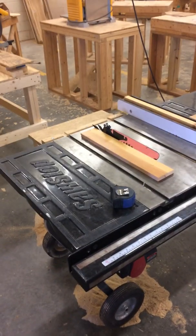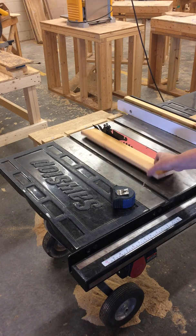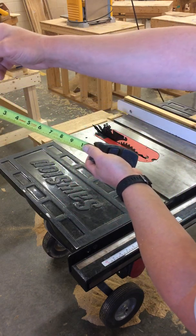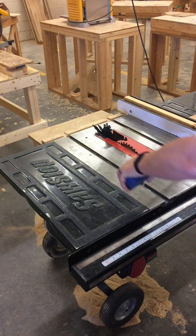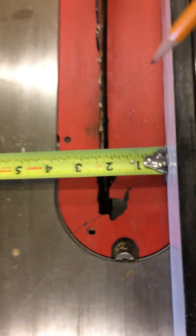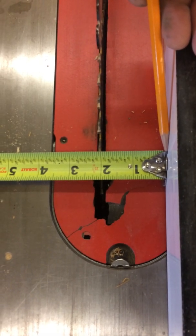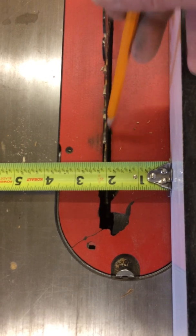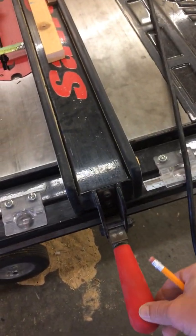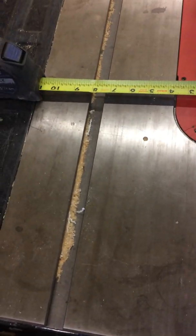That's the difference between losing your hands or not. Now I'm going to set my fence. I'm going to rip a piece that's two inches wide. We use table saws to make rip cuts. It has a measuring guide on it, but it's pretty worn out. So I'll use a tape measure — I'll place it against the fence and look at the two-inch line and line it up with my blade. You can see the two-inch line lines up with the right side of the blade, because it's going to take an eighth of an inch kerf out of whatever you cut. Now I use the handle here to lock it down and double-check to make sure it hasn't moved, because sometimes the fence will move.